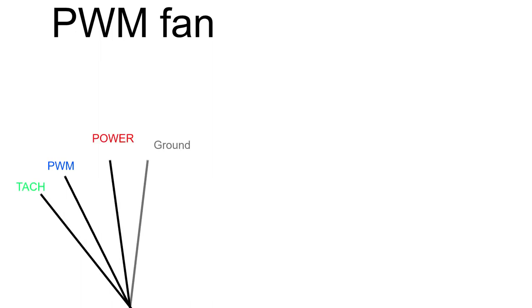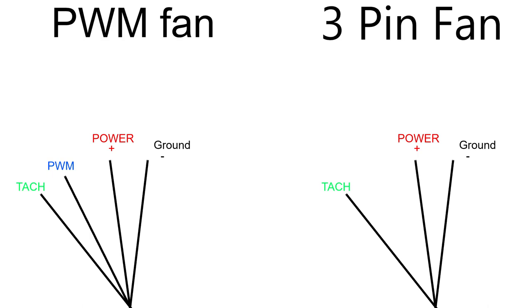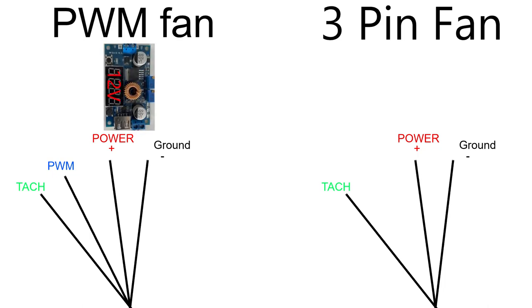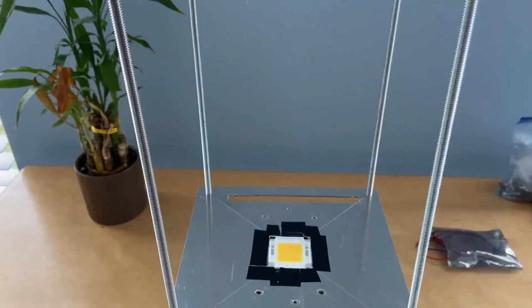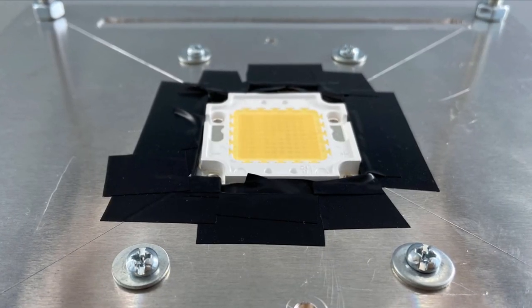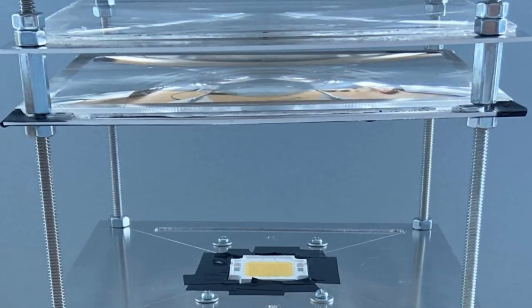To cap the amperage, turn the knob in the opposite direction slightly. Powering the fans is much simpler. For PWM fans there are four wires: PWM, tach, power, and ground. We need power (positive) and ground (negative). Generally the ground wire is leftmost or rightmost, and power is right next to it. Same applies to three-pin fans except there's no PWM wire. Once you've found these wires, set the step-down board to the fan's rated voltage — usually 12 volts. Then apply a pea-sized drop of thermal paste on the heatsink, put the LED through its hole, and screw the heatsink to the LED layer.